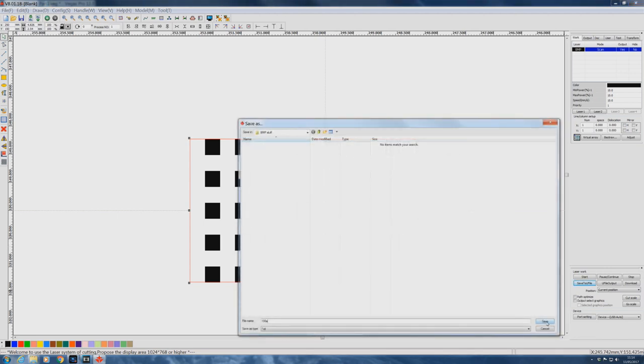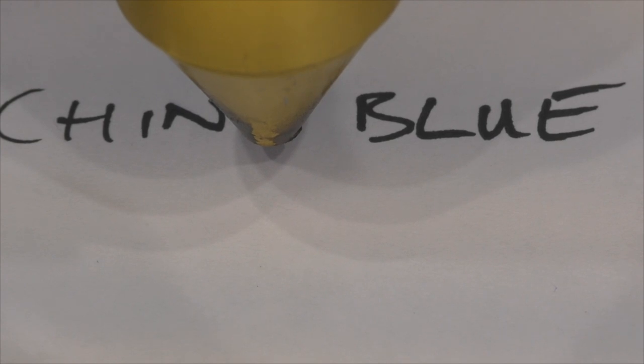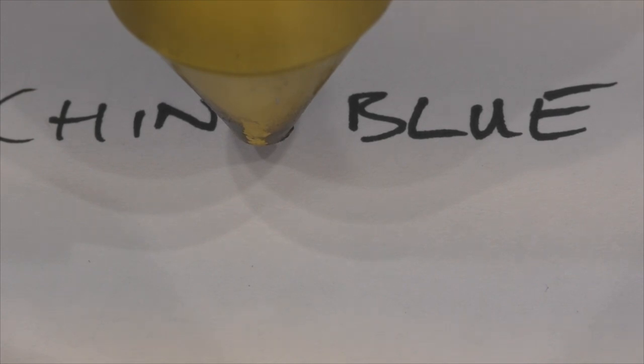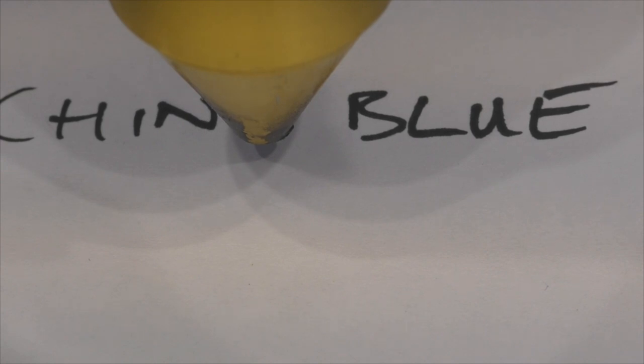It's essential to have the correct line pitch otherwise you could miss some pixels. I'm going to make all these files available at the end of this series so you can run the same tests yourself with exactly the same files. I'll provide both the pixel files and the RD files you can run directly on your machine. I did say I wouldn't bring you to the machine, but it's important you see how the machine operates in relation to the program — specifically the direction and number of strokes taking place.